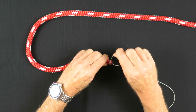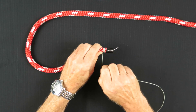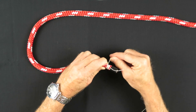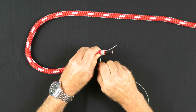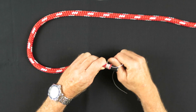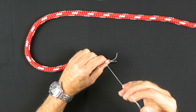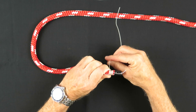If you're going to be doing a bunch of these, it can be useful to wear leather gloves because the whipping twine will cut into your hands. Keep going, one wrap right alongside the other. Part of the reason I like whipping synthetic lines — even though you could just melt the end or wrap it in tape — is the look: it's traditional, neat, and tidy. Generally, the guideline is to go the same distance as the diameter. So for a half-inch line, you go for a half-inch of whipping.